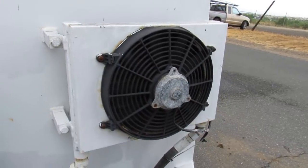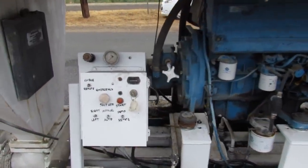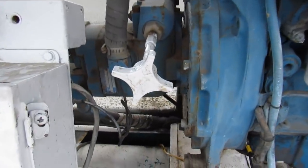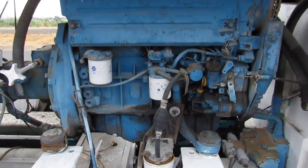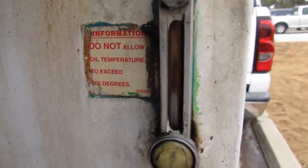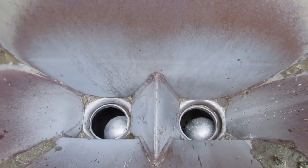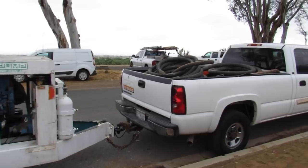Here's the nitrogen bottle — I set it at about 100 pounds with about 150 feet of hose out. The piston in the back shoves water and air into the line as you're pumping so the line doesn't surge and tear the forms up. That's a Dodge turbo diesel. There's the panel with a jog switch to manually move the cylinders, a pressure gauge, and a volume control — that's a hydraulic pump to speed up or slow down. The whole setup: two rams, two pistons, a turbo four-cylinder hydraulic pump, and a nitrogen bottle. That's how simple this machine is. You just change the poly packs and the intake and discharge balls every 200 hours. There's my setup — that's why I'm the best in the West.